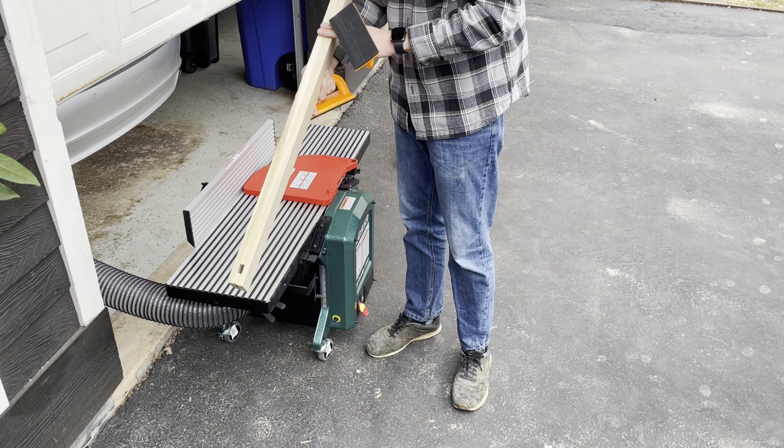Here's another close-up showing both sides. This is the jointed side — I wrote on it just so I could remember — and you can see there are no big gashes, especially on the bird's eye or the swirling patterns. This is the planed side, and it's pretty similar. Just showing you how flat it is. It was really acceptable for me for what this is. Having this capability to take raw lumber and get it square on the edges — I edge-jointed it, then face-jointed one side, then planed the other side. So I have three sides square. I hadn't run it through the table saw yet.